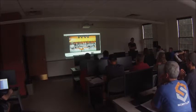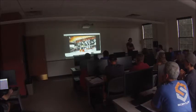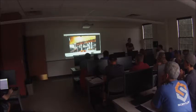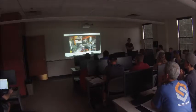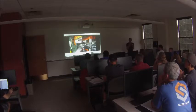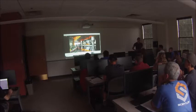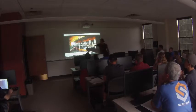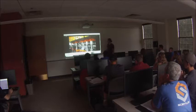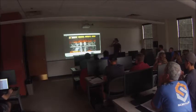And I think there's a better view. They're taking a strip of material in here, and they're doing a process called deep drawing. I used to work for a company that did a process similar to this to make shells for oil filters. But they're basically taking a flat sheet and forming it into a cup in a multi-stage process. You can see these little grippers grabbing the parts and moving them down. You can see the little parts in here. They're kind of hard to see. I think they show a better view a little later in the video.